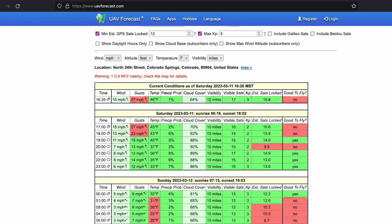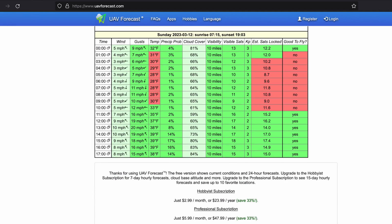The last general rule is to see if the expected weather requires you to change any flight settings a day or 2 before your flight. For example, if you notice high winds are expected in the area, slow down your drone speed so it can collect survey-grade photos. Decreasing your drone speed will stabilize the drone and prevent blurry or unusable photos. In general, weather such as wind, rain, extreme heat, or cold will limit the amount of flight time for your drone.